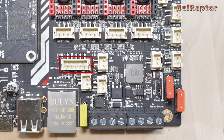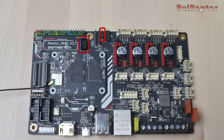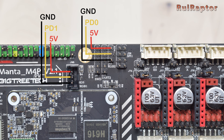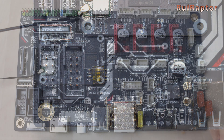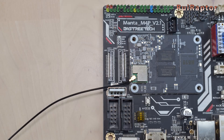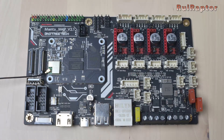There's a connector for the BLTouch leveling sensor right here, and this is the wiring sequence for the sensor. The board has two dedicated outputs for RGB lights here: the voltage pins are the top ones, the middle ones are the data pins, and the bottom pins are the ground. As for display outputs, the board has the traditional EXP connectors right here. For the modules it has DSI and CSI connectors where you can connect a Raspberry camera and display. It also has a couple of SPI connectors where it's possible to connect an SPI display.